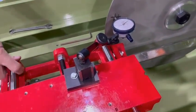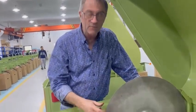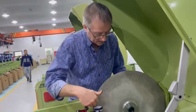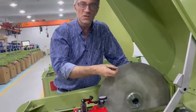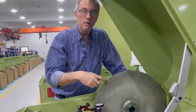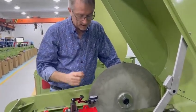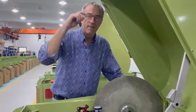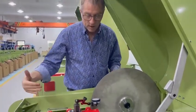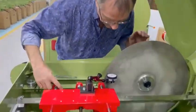When I move this carriage, I'm going to turn the blade. When I am doing this indication, I have to follow on the point — not indicate across the face. If I indicate across the face, any error that's in my flanges, that's in my run-out on my blade, that error is going to be translated into error in the alignment. By indicating the point here to the same point back here, I guarantee that this axis is going to be perfectly perpendicular to the travel of the carriage.